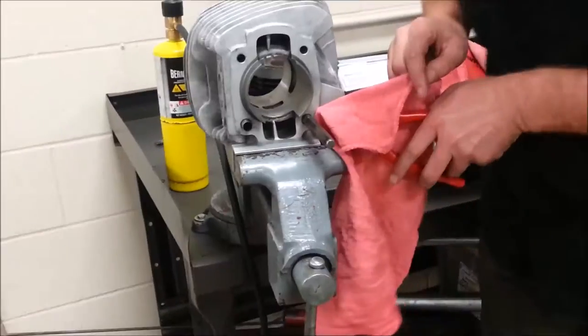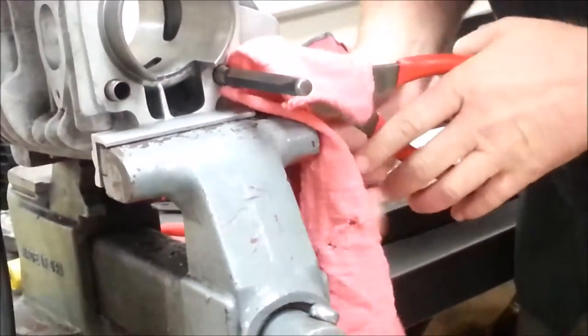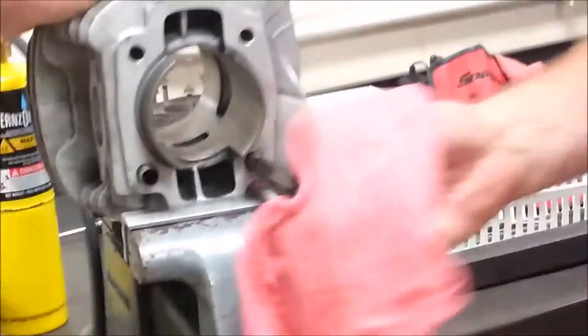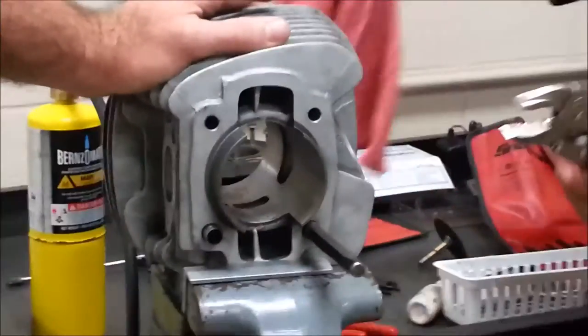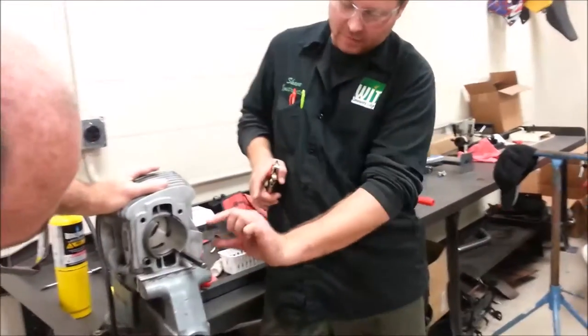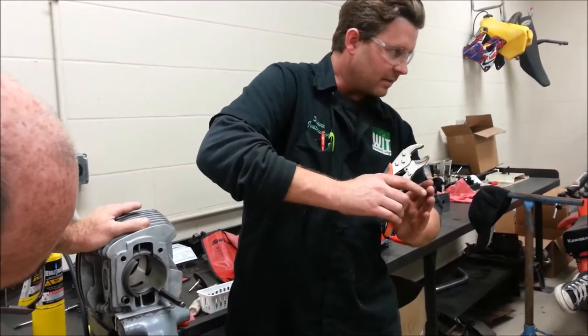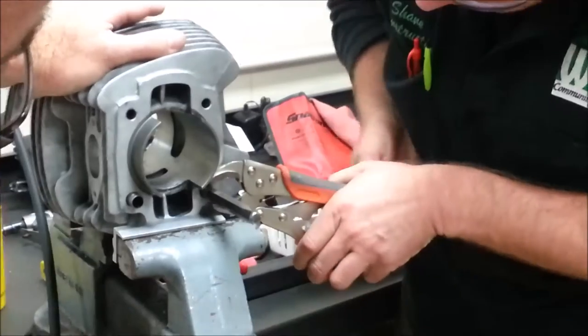I'm pretty sure I'm putting scar marks on the dowel pin at this point, so since I'm ruining it, I'll proceed. The nice thing about not crushing it is that once you crush the top, the bottom wants to kick out and actually wedge tighter into the bore. When you crush the top, the bottom pressurizes. So we'll go ahead and do this, and since we're removing it just to get it out, we'd order another one.